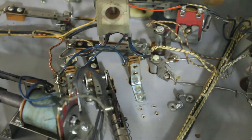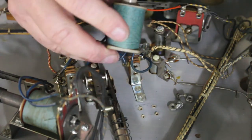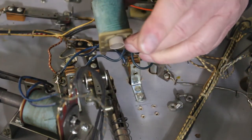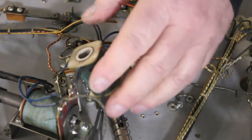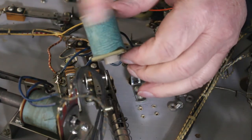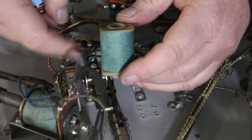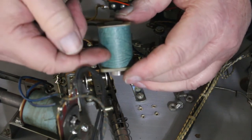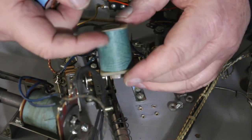You know, there's a lot of wear on that one. Now on the solenoids, there are two different types of solenoids on these machines. You have this kind that the plunger goes up in here and rides back and forth. On the other ones, what the coil does is it creates a magnetic field. And when you hit the flipper or hit the contact, it turns the coil on. Your coil becomes a magnet and sucks the plunger up, pulling and making it kick.